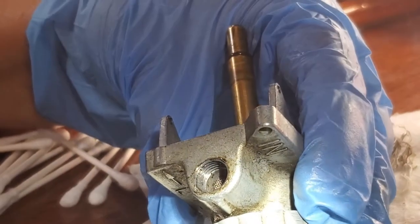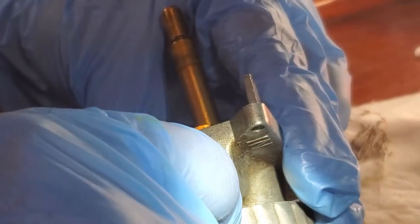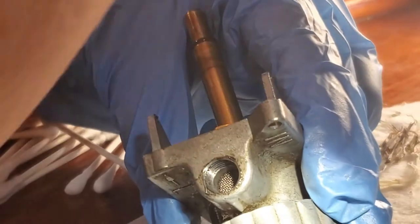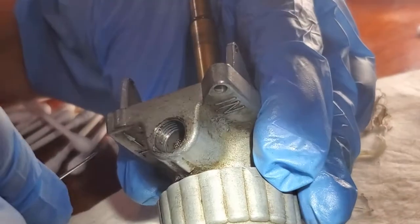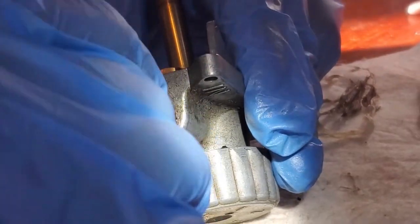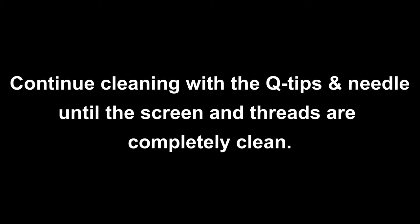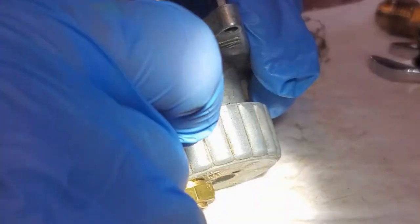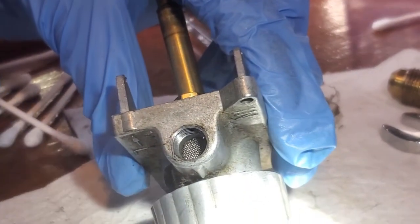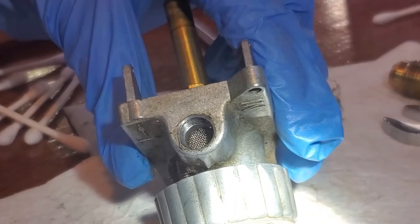The screen's starting to look cleaner — you can see the screen now. Don't push down or you'll pop the little metal screen out. Just twirl it around to pick up the dirt and debris. Now you can see it's a really fine mesh — and this is one of the biggest reasons that these diesel stoves do not work.